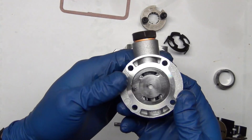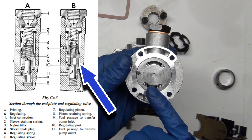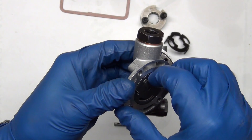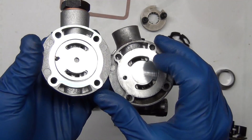This regulates and does a couple of different things. There's a small piston in the bottom that switches it between priming mode and another mode. This part is a soft metal and this is a hard metal insert — I actually switched to this from the original one because the original had a bunch of wear swirl marks on it.